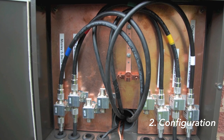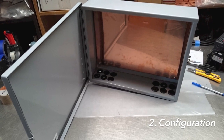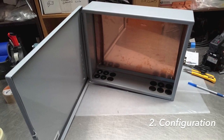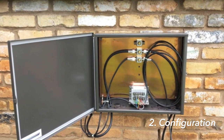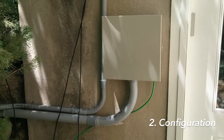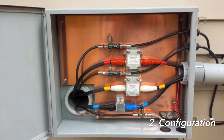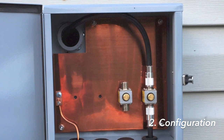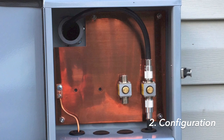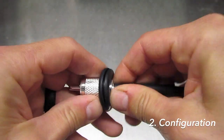Occasionally a hole has to be on one of the bottom corners. This isn't ideal because the cables have to do a 180-degree bend inside the box in order to go back through that hole. It's also possible for all cables to go in and out the bottom through a series of grommets, which are usually on the left and right sides as shown in these photos. You can also put conduit in the bottom or sides of the box depending on your circumstance. The last part of configuration is how many grommet holes you want in the bottom of the box.